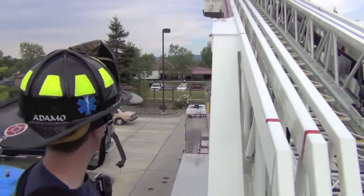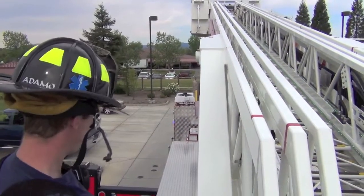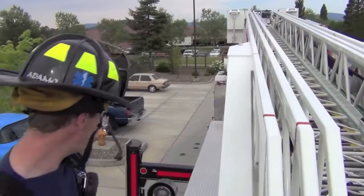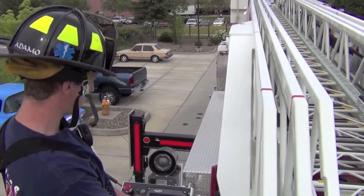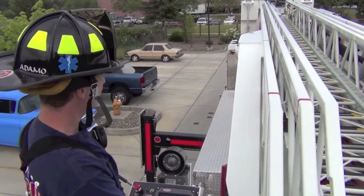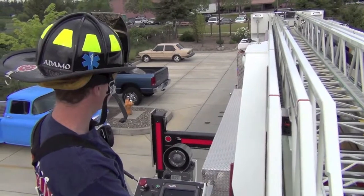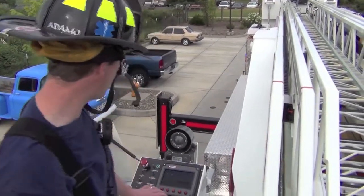Within 5 degrees of either side to center, you can just continue holding down lower. Make sure that within 10 degrees angle, it shows a line for stowing, and hold down until you see the 2600 psi on hydraulic pressure, or until the high idle shuts down. High idle is shut down, so I can release my lower control.